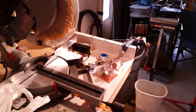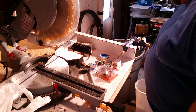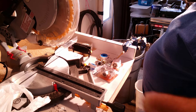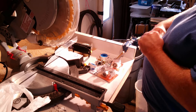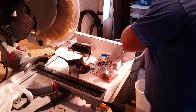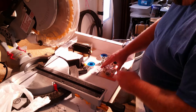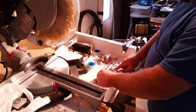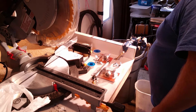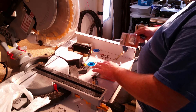I'm going to add a new drop to our MaxLine rapid air system - that blue piping they sell for shops. I was going to bring air into the shop but haven't had time, so I just need a drop outside close to the garage. I've got a tee for when I cut the line in the garage, and a fitting that comes off the blue line and converts over to the pipe that's going to come down the wall.